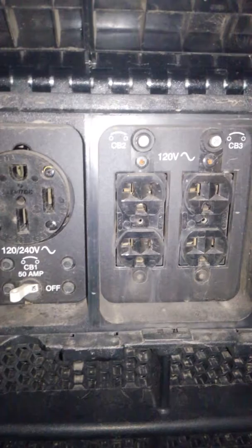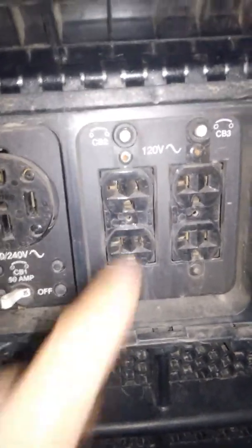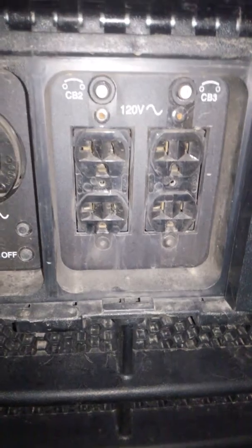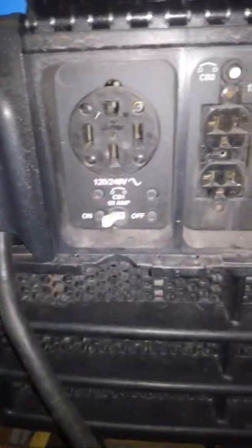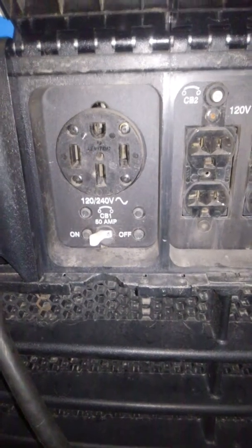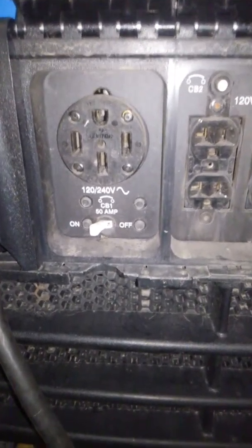Just passing it on — easy trick, saves a lot of wear on the machine. The first couple Bobcats I had, it actually cooked the 20-amp breaker and then fried an inline fuse inside too — they just went totally dead. Wish I'd have known that sooner. Quick tip: pull off your 220 so you can pull on a 50-amp breaker, split the legs in your box to your 110, and you're good to go.